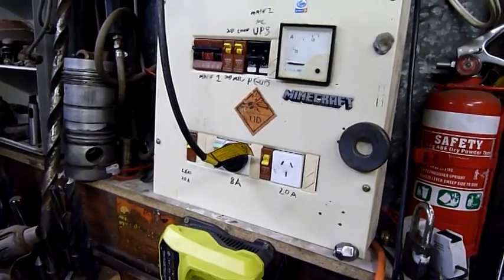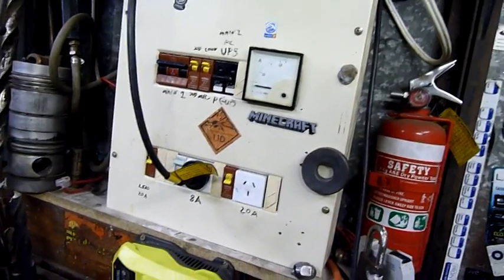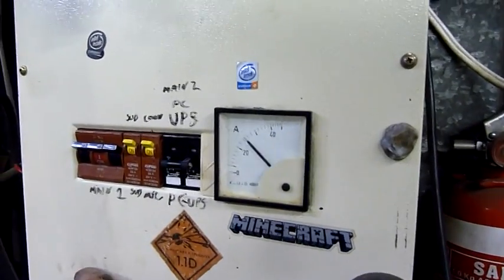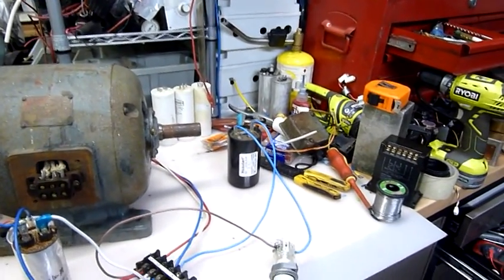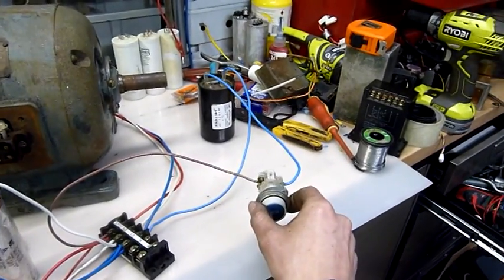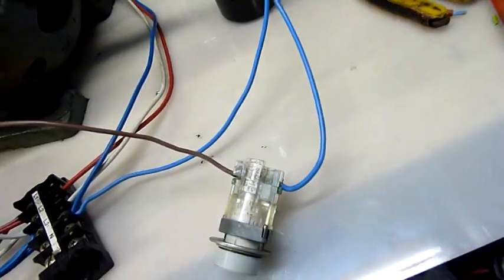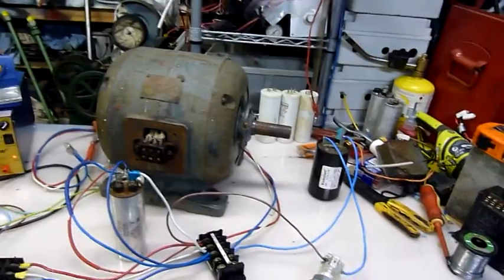Okay, let's start the RPC first. I really need an automatic start capacitor thing. Let's see what the inrush is. Oh, that's healthy — start on. There we go. Need to get rid of that. The diagram says you can use a push button, but I don't like that — it's a safe push button, but I don't like the way my breaker sits at about 30 amps for a couple of seconds before I can get to the button. I'll replace it with one of these.